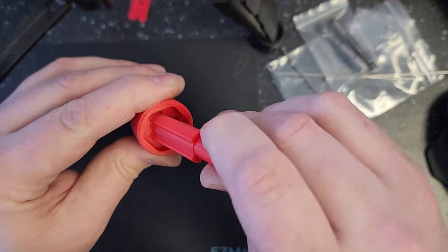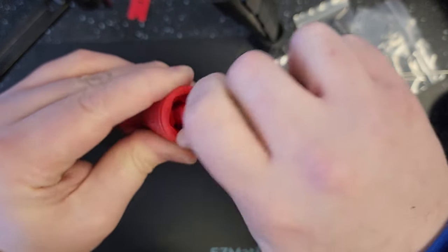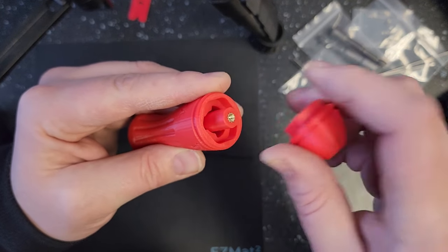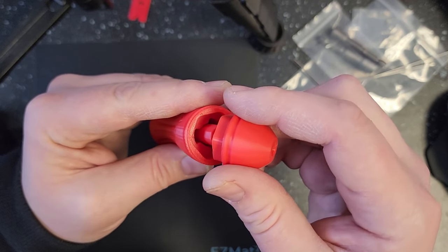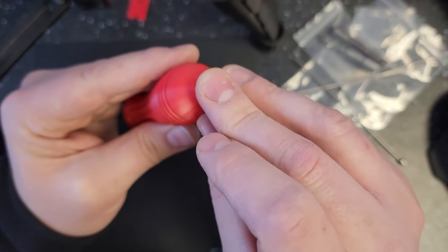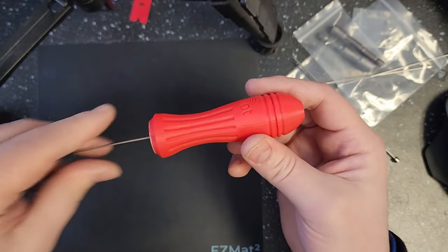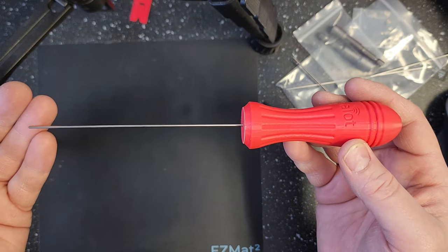Take the cam, put it in, and then turn it clockwise — this will lock the cam in. After the cam is in and it's not coming out, go ahead and take the back piece on, making sure to align the little angles up with the one on the screwdriver handle. Put the M3 bolt in the back and screw it in. Do not over-tighten this. Now we have the assembled pusher and you can use this to unclog your hot end.